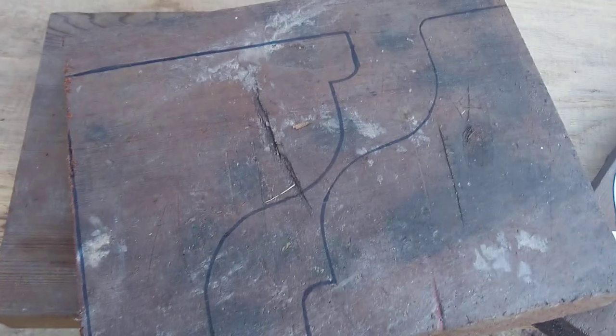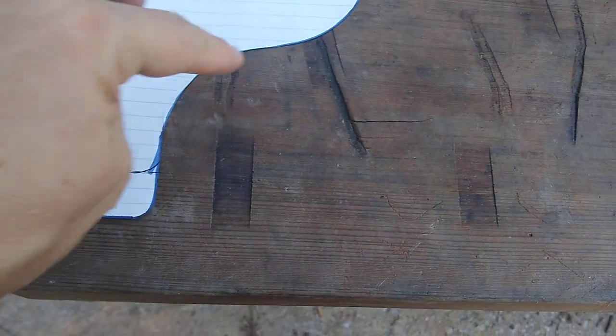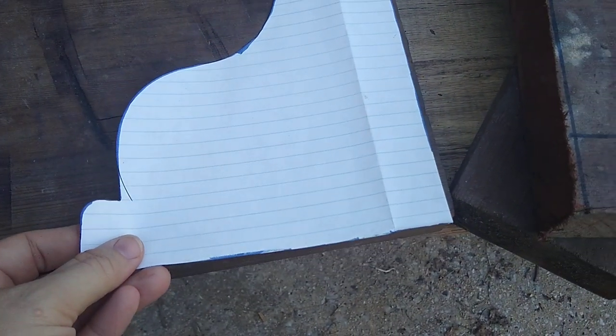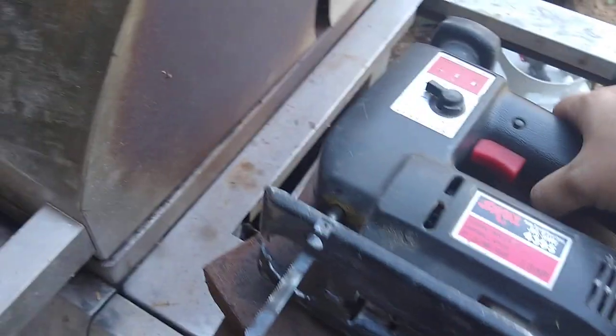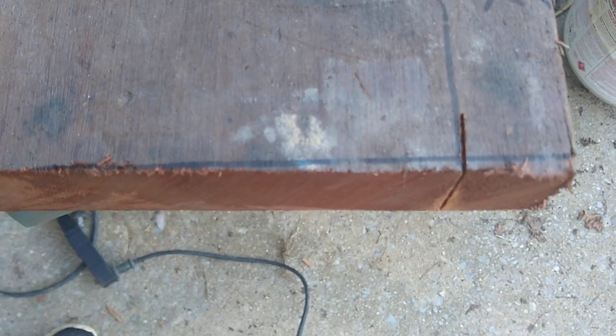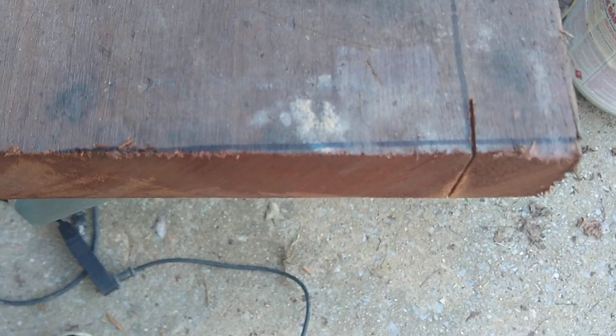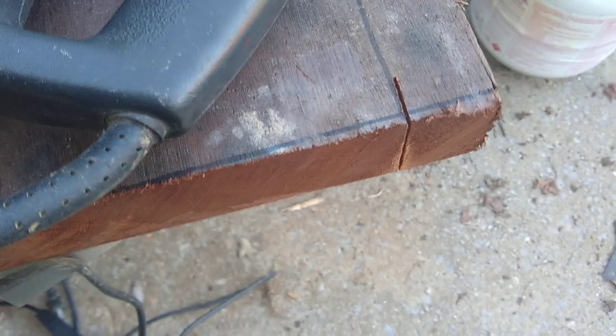I'm just going to repeat this process and then cut it out with my jigsaw. Even better is to line these up on the top and the side so all you have to do is cut the design — then when you flip the second one, line it up on the bottom and the side. Especially if you're not using scrap wood, everything from the store should be relatively straight. My jigsaw is very old and this wood is very old, so it's going to take a long time. I'll jigsaw them and sand them and show them to you in the next video.